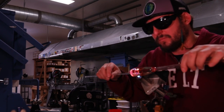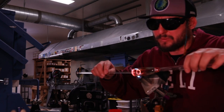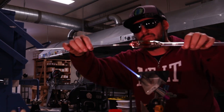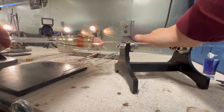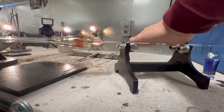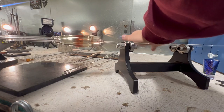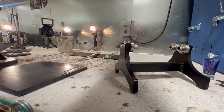If this doesn't go right while you're tooling the shot glass open, it could break off and fall off. So just making sure everything's perfect here. Drop it on the roller and make sure it's centered. You can see the basic shape starting to take form and you can see the little moil on that 6mm handle. That's just going to leave me a little more to pick off at the end. It's more important that the seal to the bottom of the shot glass is solid.